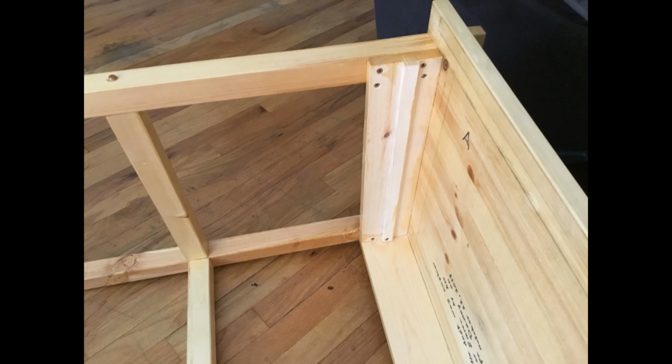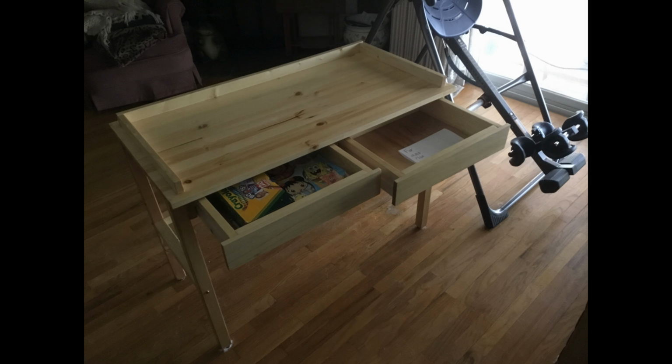And another shot of the underside, and there's the two sets of screws that go on the legs on the other side. And there's a dowel to the left. It's going through the leg into the cross member, and that's a real functioning dowel, glued and screwed. And it functions well. It works solid. Again, very simple, but yet it's nice joinery, very clean.